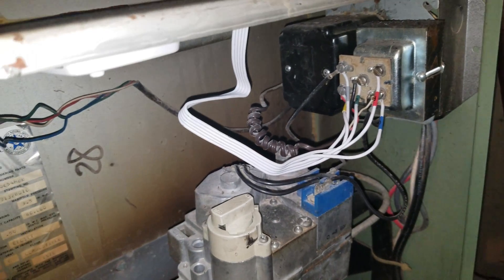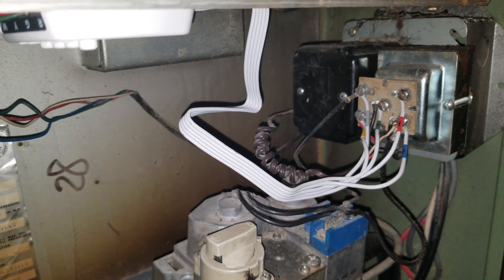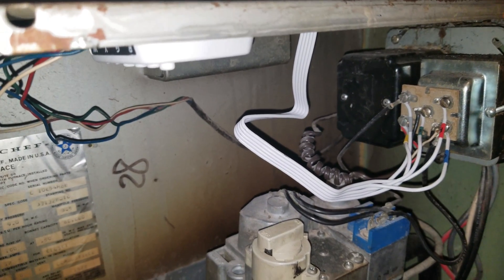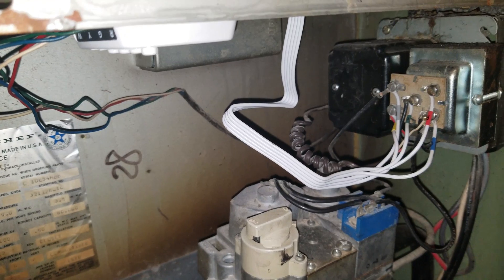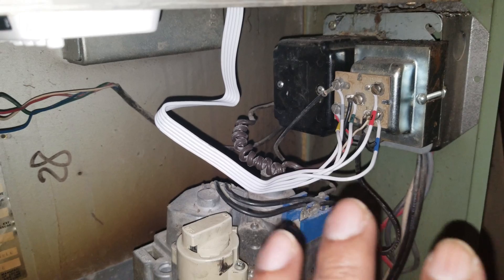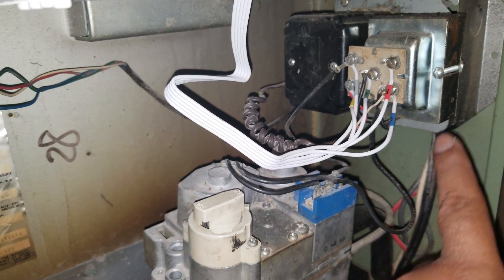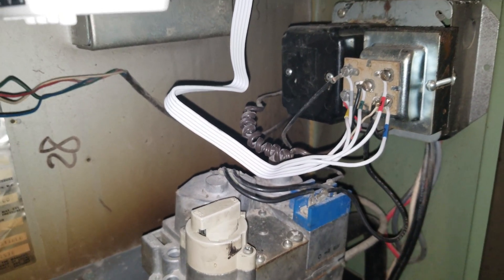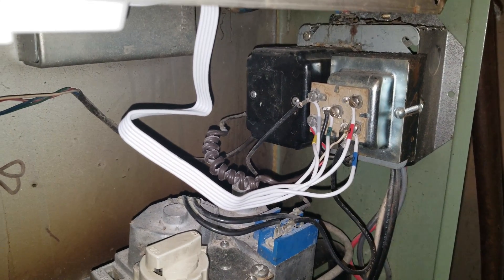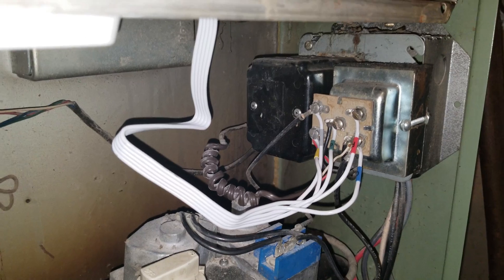This guy is ready for us to go ahead and install the top part and do some testing. Now before you do anything else, I would absolutely recommend, especially dealing with one of these older systems with a transformer, make sure you get a voltage meter and measure your voltage at each one. Make sure you're doing the right thing here. If you're concerned about doing any of this, call a professional. Make sure you're wired right because some of these transformers may not be putting out 24 volts — they may be putting out 12, or even a voltage that could kill your new Ecobee. So just be careful.